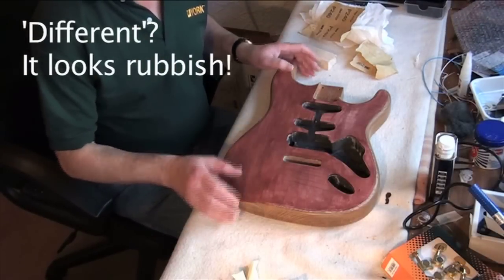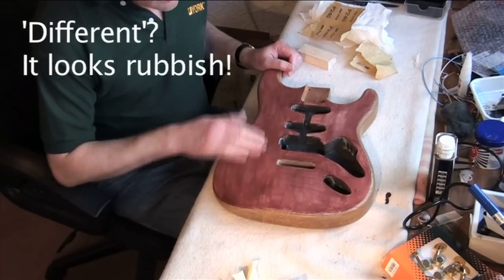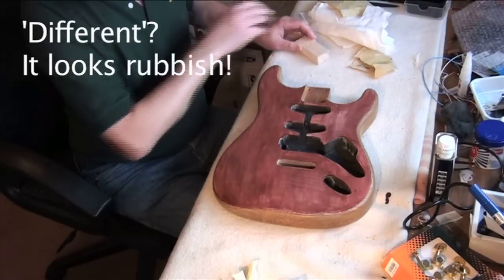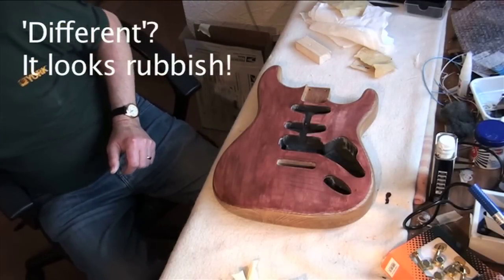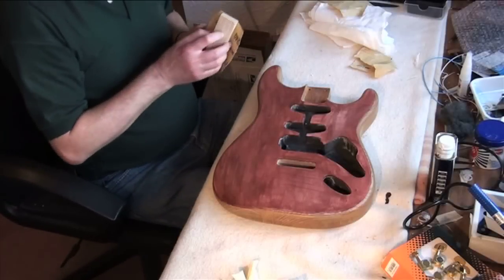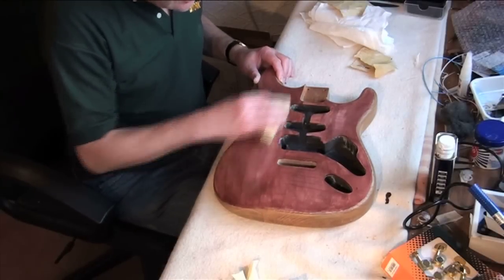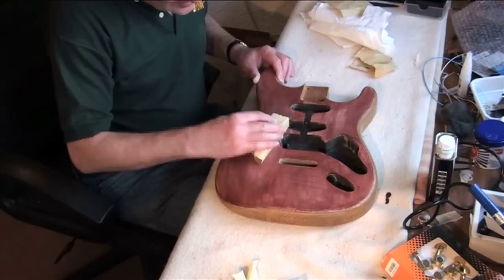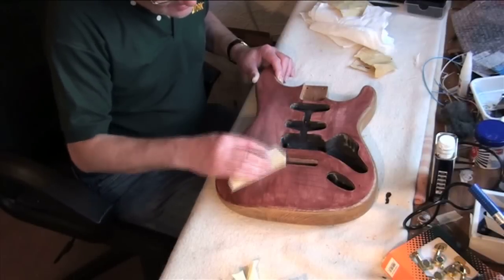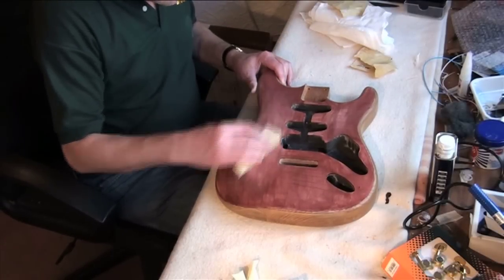I've left the wood dye to dry overnight. It is now perfectly dry and if you have a good look at it, it looks really poor — blotchy, it looks like a kid done it to be honest — but that's fine for reasons I'll show you in just a moment. I'm getting a new clean bit of 240 paper, because what I'm going to do is sand most of this off to bring up the underlying flame underneath. In so doing, all the unevenness that you see in that first thick coat of wood dye will start to disappear, because most of that dye is coming back off again. What you're left with is a much paler wood with a much deeper looking grain than we had before we started.